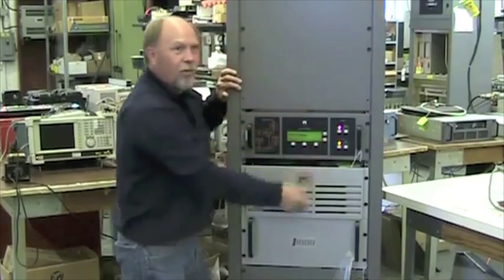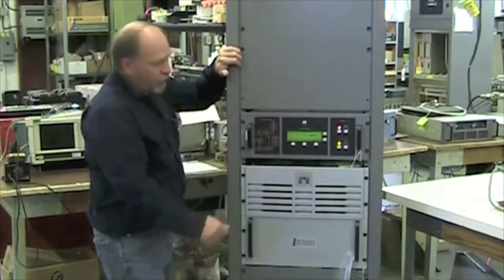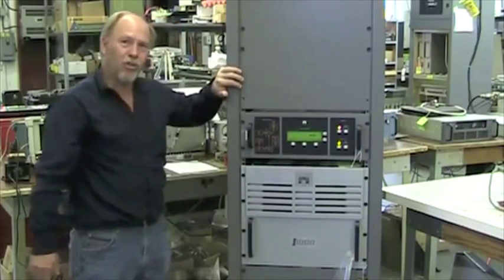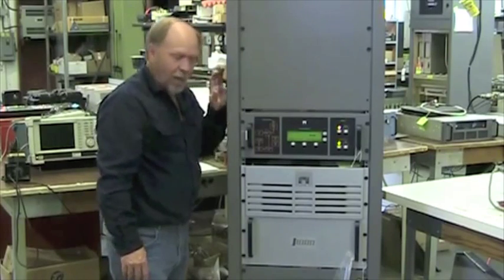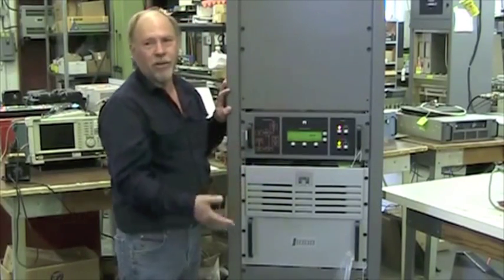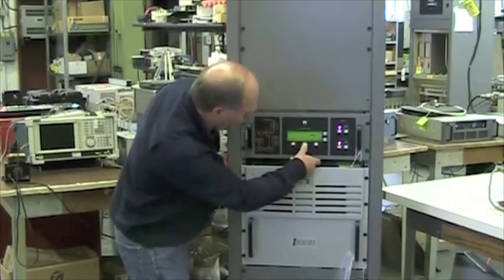Next one is the thresholds. This is preset in the factory. You can adjust the contrast in this display. The RF current standard would be shipped at 235. I suggest never changing that. When you get high power and high modulation, this may trip. AC sags a little bit, may cause it. It's protection. I wouldn't change it whatsoever, even if somebody from Nautel advised it.